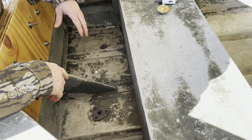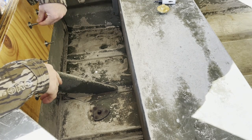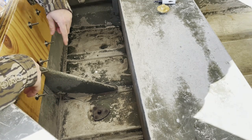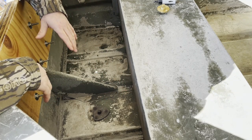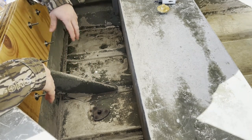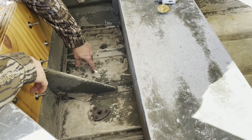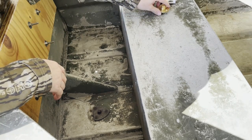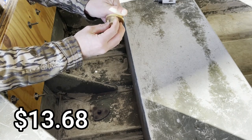In the first video I said I was going to try to get it out, and I tried. I tried heat and that didn't work — I couldn't even get it to budge. It was actually smoking, and looking at it, it looks like somebody epoxied it in there. I'm scared to put too much heat with the risk of warping the bottom of the boat. I already drilled a hole over on this side just to get the water out, because I decided to go ahead and add another plug. What I came up with was just this brass plug — I think I got it on eBay for like 10 or 12 bucks.